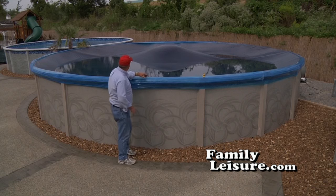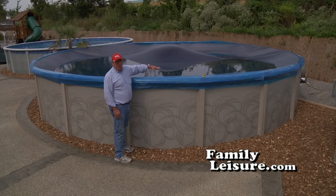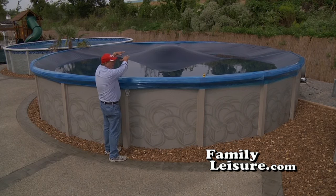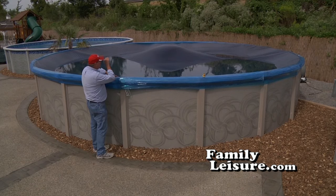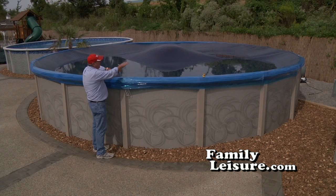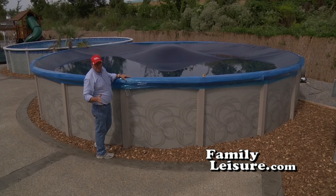After the cover is installed, you want to make sure there's a moat of water all the way around the pool. This water holds the cover so that as rainwater comes down, the ice pillow will move up and down to compensate. The air pillow or ice compensator pillow floats. Any excess water on the cover will displace water up and under the cover and out through the skimmer. Whatever you do, always keep water on it so the cover does not blow up in the air and pull on the sides of the pool.